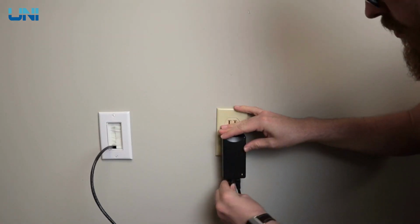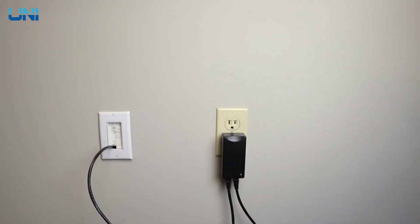As you can see, it's super easy to get these Univiews fixed lens cameras installed, set up, and ready to go. Now it's time to hop onto the web and NVR interface to see what these cameras can do. First, we're going to log into our camera's interface via the web browser. Now this is just the camera itself plugged into a PoE switch. So if you don't have an NVR, if you're going to be using this camera as a standalone camera, this is exactly what you'll see.